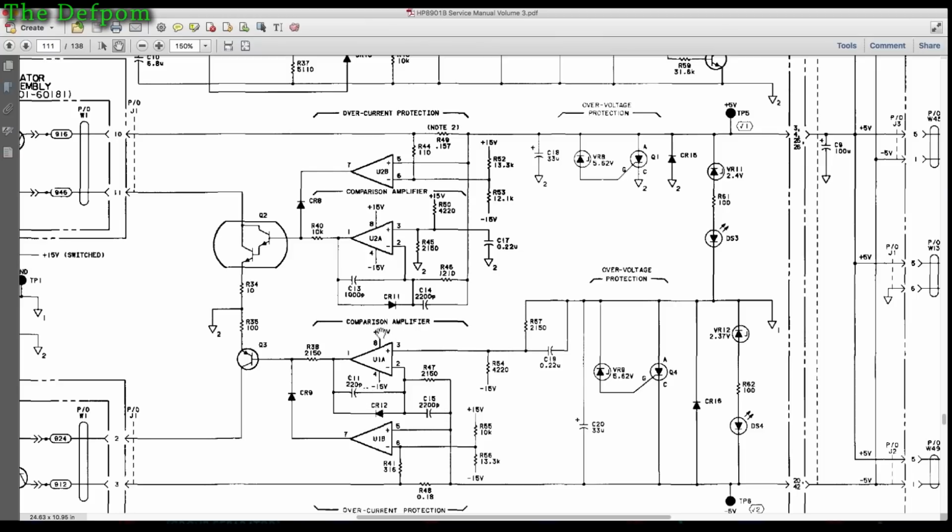But this is why that 15 volt rail, or the negative 15 volt rail even, is influencing the actual supply output, because that's what's controlling the op amps, which are then giving the final output. So that's why changing the 15 volt rail there changed the 5 volt reference, because, well, both of them, because it's running through those op amps. So it's changing the supply voltage to the op amps, and it's actually shifting the offset very slightly, effectively.